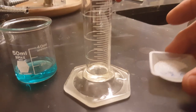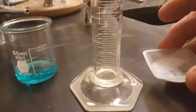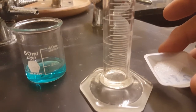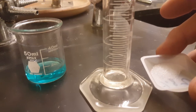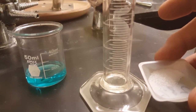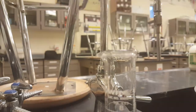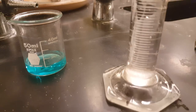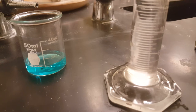Here's the sodium chloride calculated for my silver mass, times two. We double it because we want to make sure we precipitate all of the silver — we don't want to leave any silver behind. Using excess sodium chloride pushes this reaction all the way to products. Put the salt in first, then add your water. Use your stirring rod to get the table salt to dissolve; this might just take a minute.